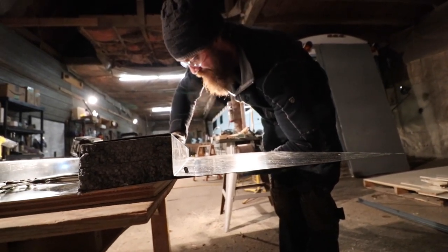It's nice when the rivet lays flush against the skin, so that's why we feel for burrs. And sometimes if there are burrs, Brian will wallow out the hole just a little bit more so that it's smooth, and then the rivet lays flat and sucks the sheet metal together nice.